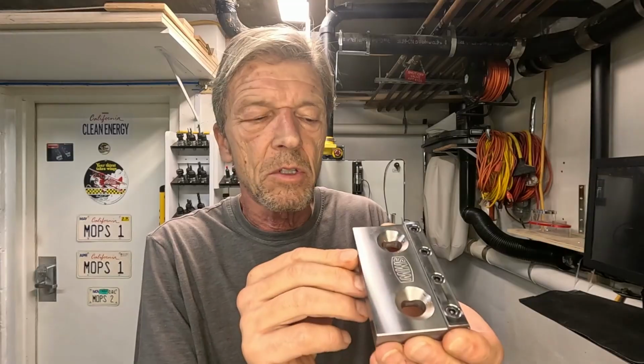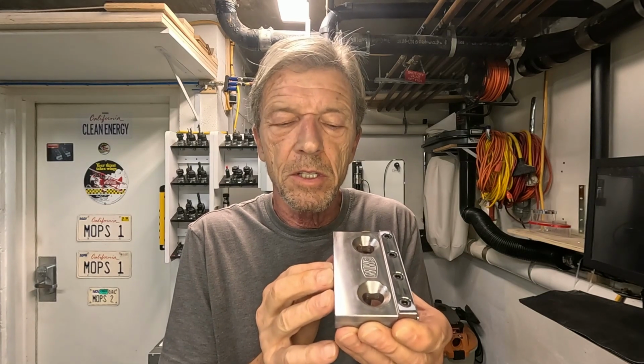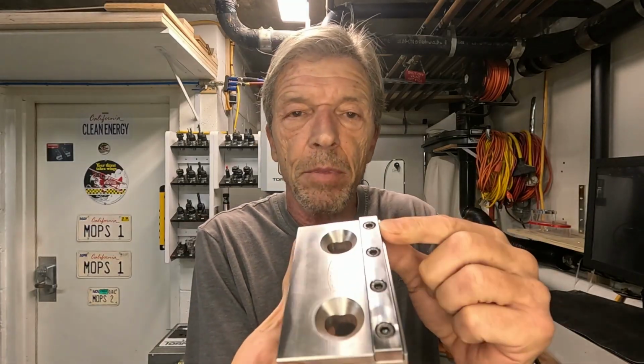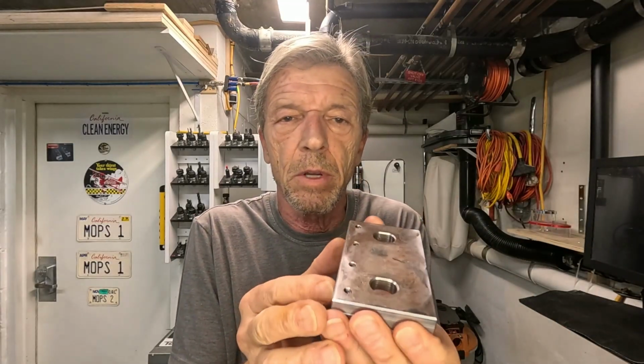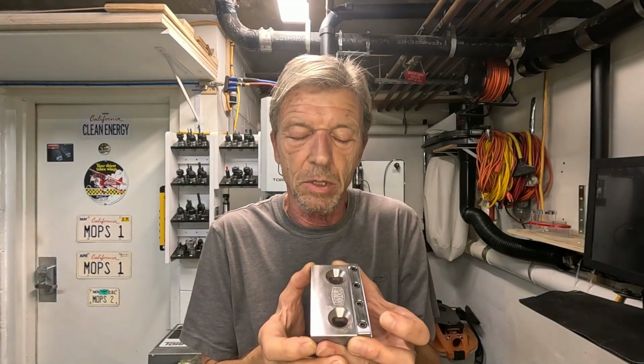So this is the original steel jaw of SMW's mod vise. What we're going to do is we duplicate this part, make it out of aluminum 6061. 2 differences. We're not going to have this clamping bar. Ours is just a solid block out of aluminum, and we're going to have the same tapered openings on both sides so that we can flip over the soft jaw and use it multiple times for different projects. So machining this part out of aluminum is easy and straightforward.